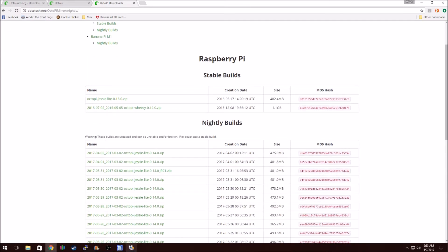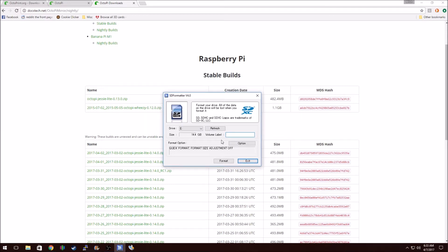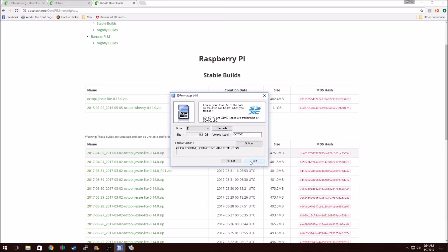I download that, and if you've ever used this before, it's called SD Card Formatter — I'll have the link in the description below. The trick with the SD Card Formatter is if you use a lot of Raspberry Pi stuff, they partition the SD cards and reduce the size that Windows will see. So I just go into Options, click Format Size Adjustment on, and you can label it — like 'Octopi' — and then just click Format. It goes through and formats it as 16 gigabytes formatted. It's a Class 10 card, 16 gigabytes. That's all we need for that.